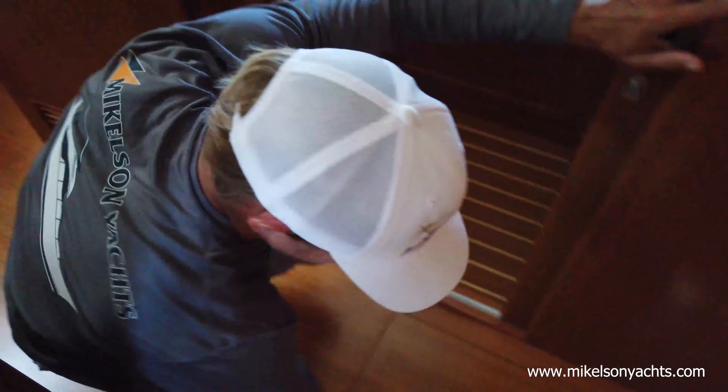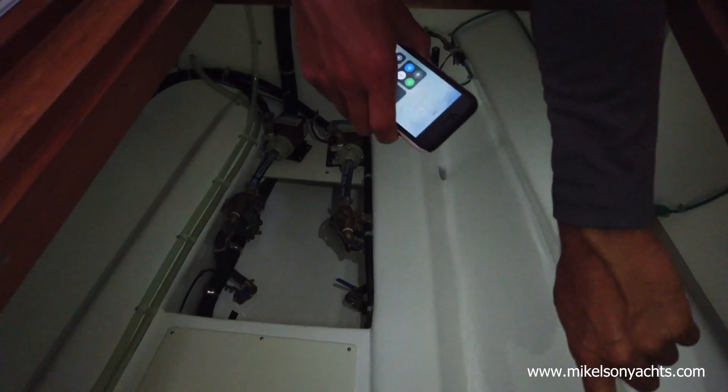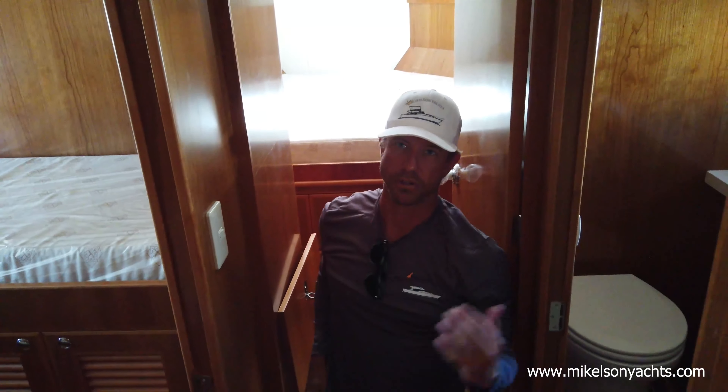Let me show you one really cool thing since we're doing kind of behind-the-scenes stuff here. This area on the Nomad is really really big — this is usually where we put the sonar. It even goes back under here. You've got your shower sump and water tank — a lot of our customers store spare parts down here. You can see the stringers — these oversized stringers run through the whole boat. The stringer is what gives the hull its structural rigidity and integrity, keeping everything together forward to aft. Bulkheads give it port-to-starboard strength, and web frames run between the stringers port to starboard fore and aft.